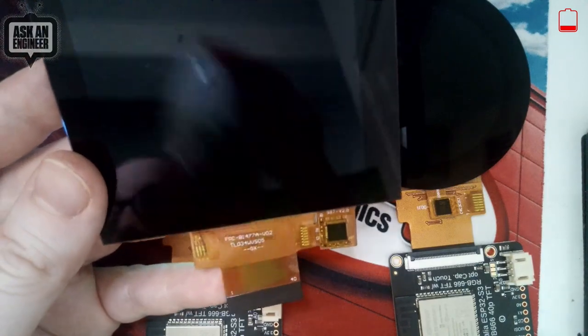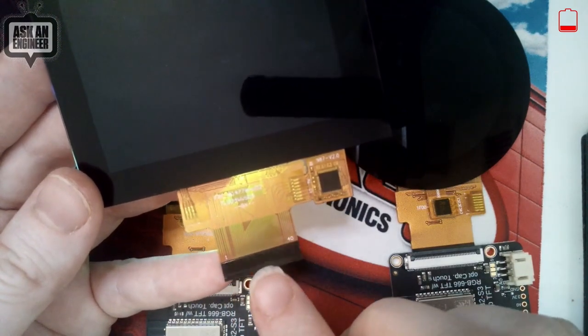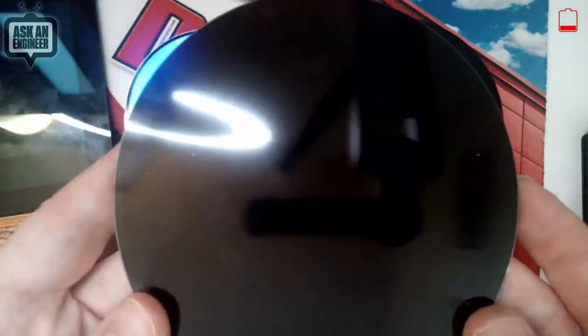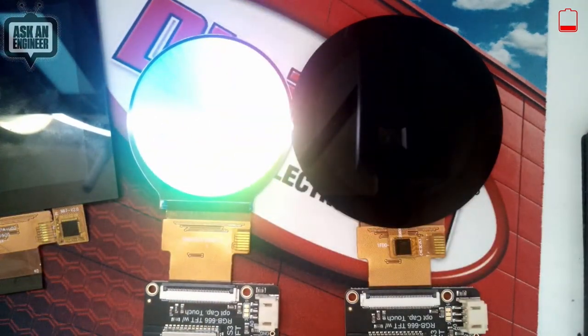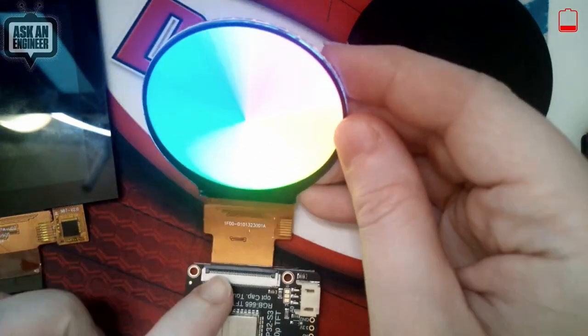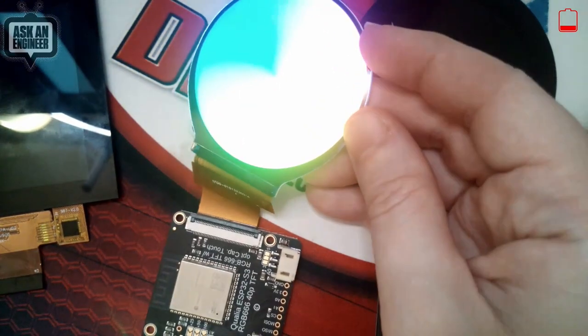So yeah, square screens. The thing is that the pinout it works with doesn't work with every screen with a 40 pin display, but usually these, I call them RGB-666. They have six bits red, six bits green, six bits blue. And then they often have capacitive touch here on the side. So this 3.4 inch square, this round display, this huge round display, this bar display, these non-rectangular ones tend to work the best. If you see something that's 480 by 272 or 800 by 480, that may not match. You'll have to make sure that you have the right pinout on here for it to work. There's a backlight driver, so a little booster to drive the backlight.